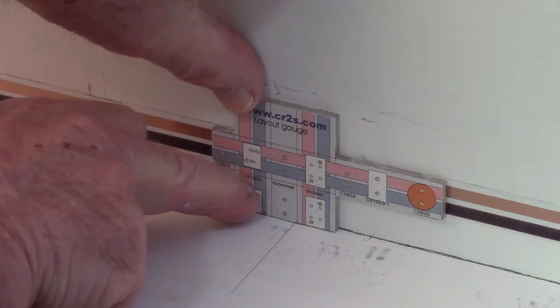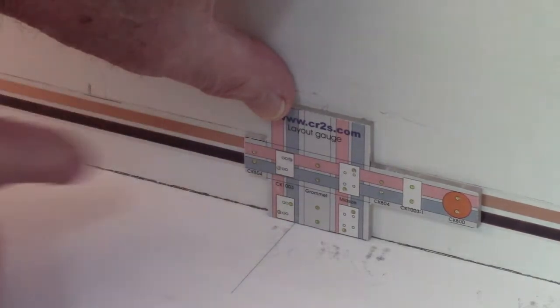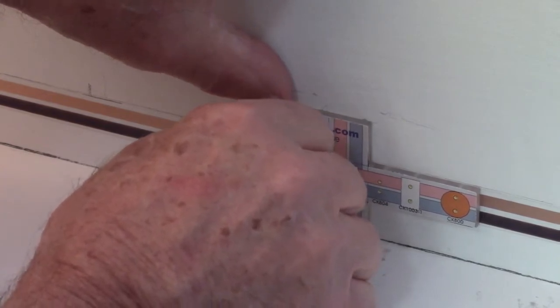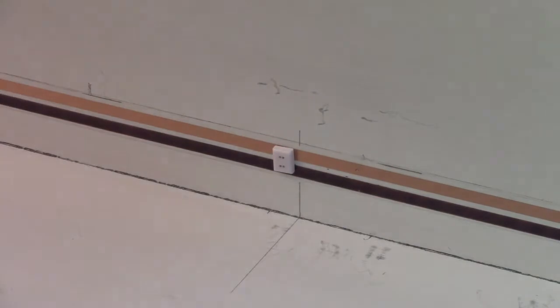It's actually marked underneath here as Circuit 1003, which is their wall outlet. I can move this around — I put a line on the floor approximately where I want the outlet to be, and I can go in here and find the holes in the guide and just make a mark. Then I can come back with the outlet itself, find those marks on the tape, push it in, and we've made a connection into the flat tape. It's all there is to lining it up — we're perpendicular and it should work just fine.